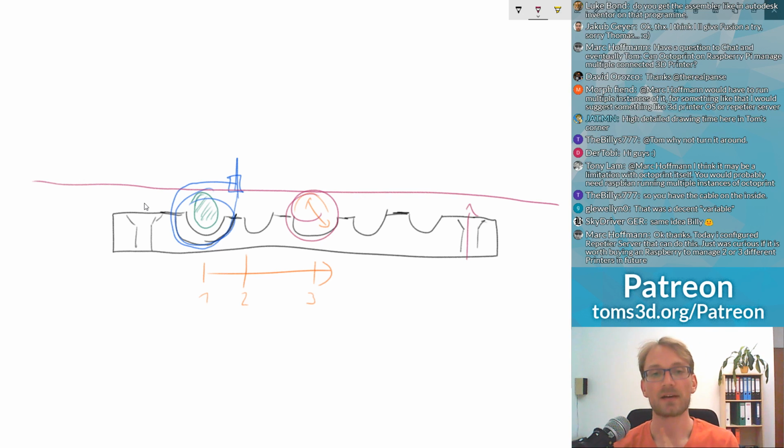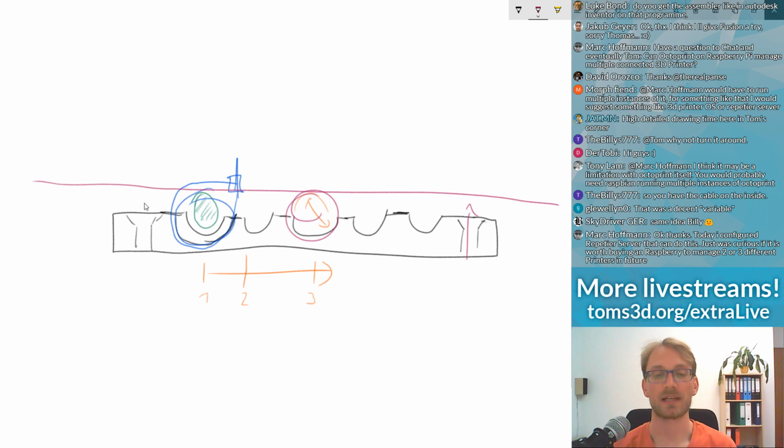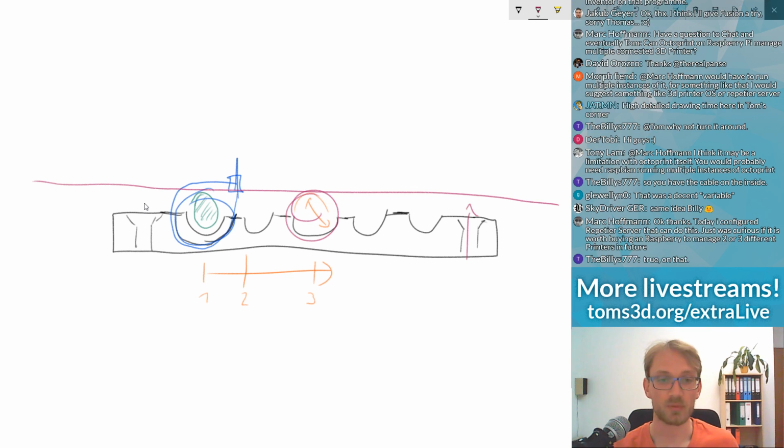The problem I have with that, it wouldn't need zip ties, obviously. The problem I'm having with that, it's hard to take out and insert cables, and when you screw this down, you will need to arrange every single one of these perfectly. And if you have cables of a different diameter, it's not going to clamp every cable equally well. So it would be more of a cable carrier, I guess. This is just, then, open up the zip ties. Zip ties are free, essentially. They're so cheap. Cut this thing open, insert a new zip tie, zip it down, and this thing is going to be solid.